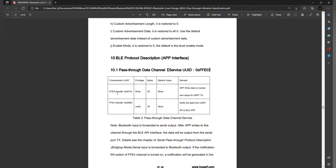Your initial service UUID is going to be FFE0 — you'll be able to find this in the custom profile section of the application. To write data the ID number needs to be FFE9, and to receive data the ID number needs to be FFE4.